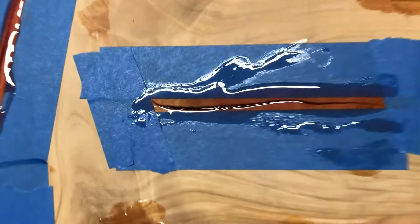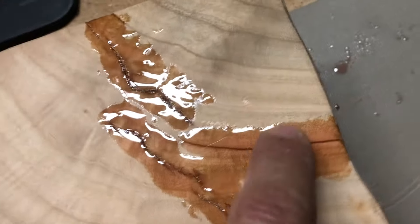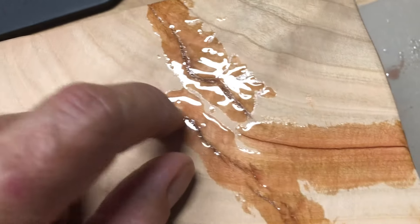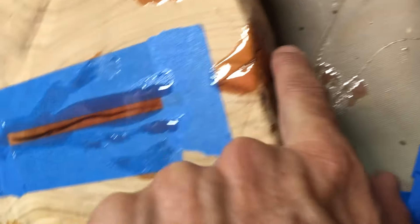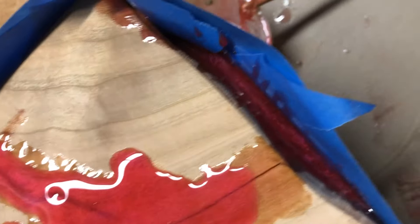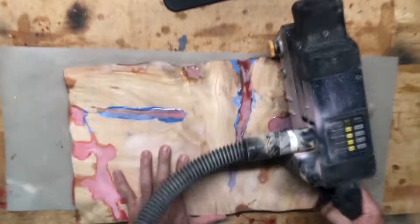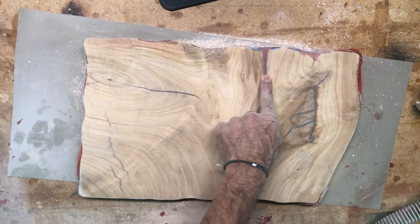Next day — the results are pretty good on this one. There is a dimple going down, so we're going to pour a little more into that. These micro cracks: some are good, bridged across, but others are rough and it's settled down inside, so we're going to pour a little more on top. A lot of the ones on the side didn't go in even when it was thick. Now it's puddled on a little deeper — the belt sander will rip all that off flat. I put some tape on the side and poured in the extra, hopefully going down into the cracks on those ends as well.